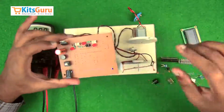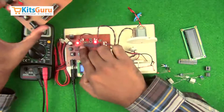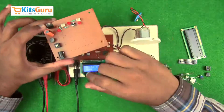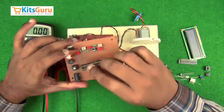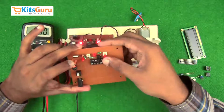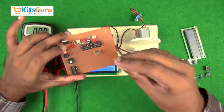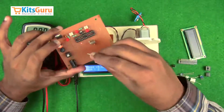This completes the power supply section. Now we'll connect the IC. Before inserting the IC, we insert the IC base. There is a notch on the IC — the pin on the left side of the notch is pin number 1, and counting counterclockwise, the pin on the right side of the notch is pin number 28. We insert the base first to protect the IC during soldering and to allow easy replacement. On top of that we insert the IC. It works on a clock frequency, so we insert a 16 MHz crystal oscillator and two ceramic capacitors of 33 picofarads each in parallel to start the oscillation process.